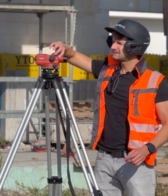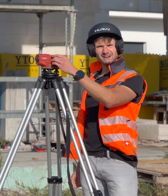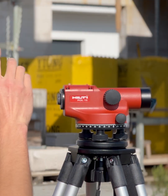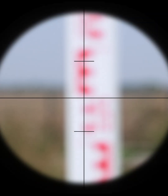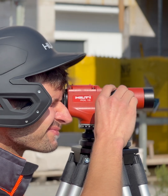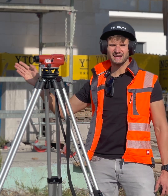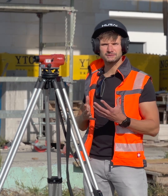And finally, this bigger side screw sharpens what you see through the telescope. Look with the telescope at the leveling rod — at first you see it completely out of focus, but by turning this screw you sharpen the image and see clearly both the rod and the crosshairs. And you can read the value. Easy.